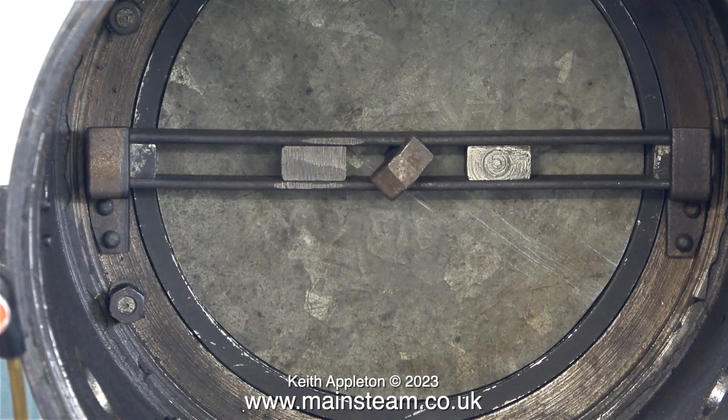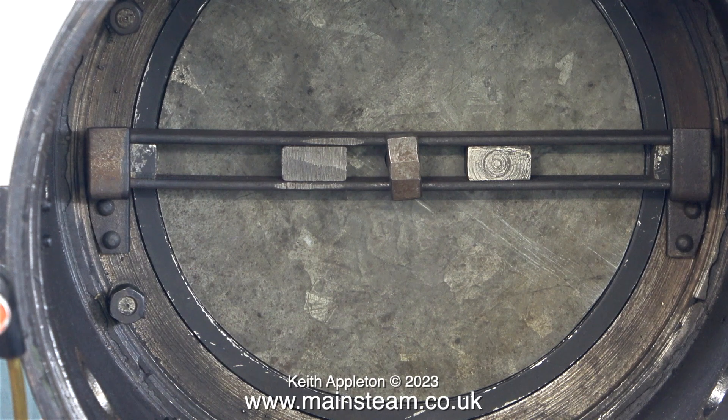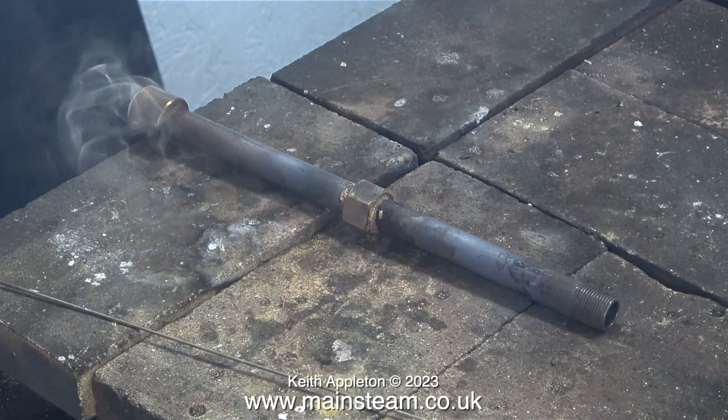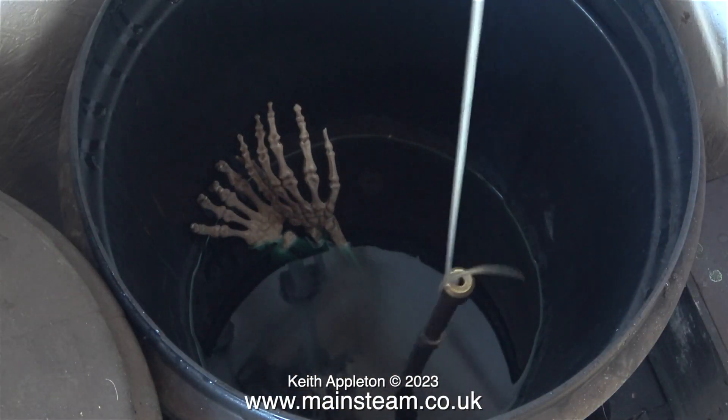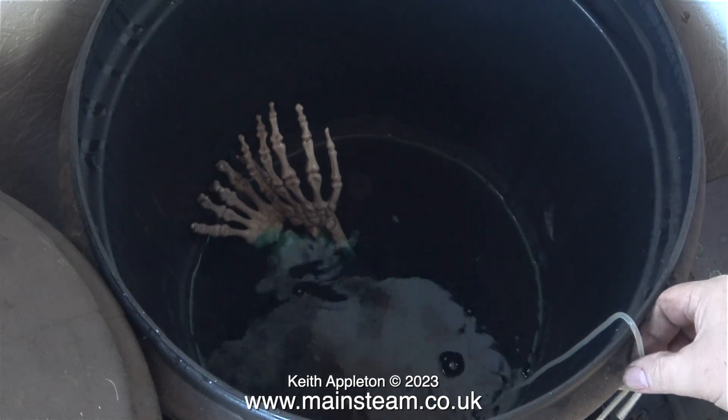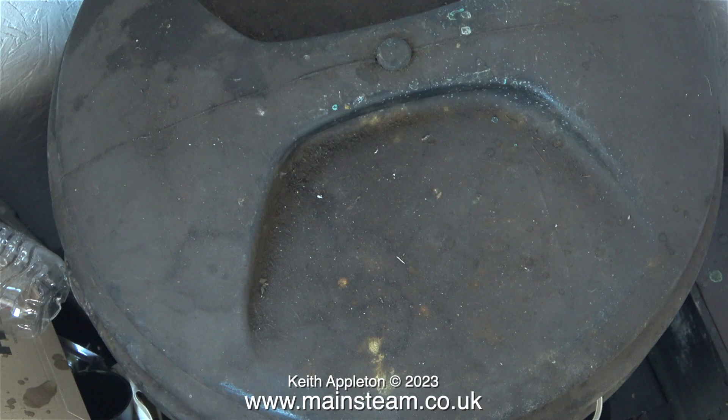I'll show the principle from the other side as it's easier to see. I'm sure there probably is a set angle for the position of the two locking handles — this one is set at 20 past 6 — but I'm sure some experts will write in and tell me what it should really be. However you do it, it's most important that the smoke box door is clamped very firmly to the smoke box itself. As a special bonus, here's another shot of the blast pipe cooling. Once it was cool enough to handle, I attached some silicone rubber tubing to it and loaded it into my acid bath to remove any oxidisation. Once it's nice and clean, I'll paint it black. And that is it for this episode — simple jobs that took quite a long time to complete. Stay safe, stay healthy, thanks for watching, and I hope you found it useful.